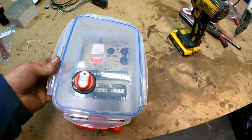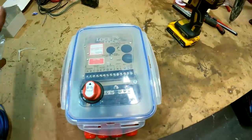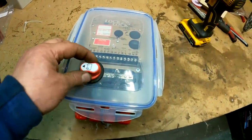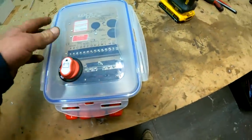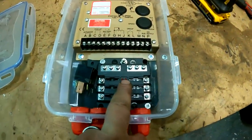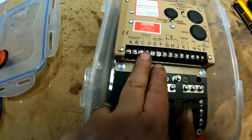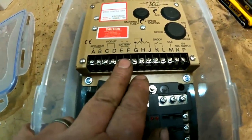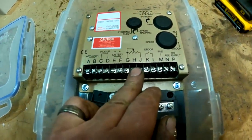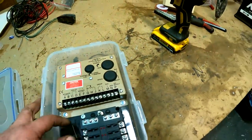So we've made our splash-proof box. We've got a main isolator here which will basically turn everything off, and you can actually take the key out so no one else could use it — though I'll probably lose the key. We've got a little six-way fuse box; when a fuse blows it gives you a little LED indication which I think is quite nice. We've got actuator pins, a pickup from our speed sensor, battery input, a remote idle control, and output. I have all the paperwork so I'll look through it.